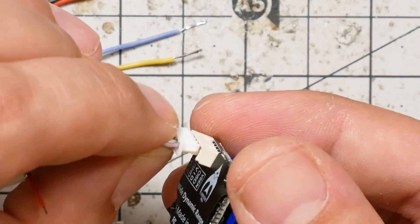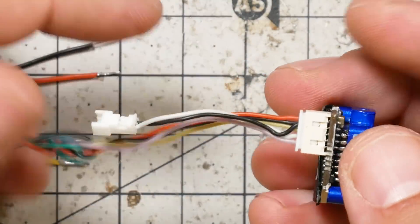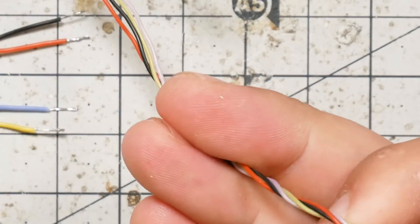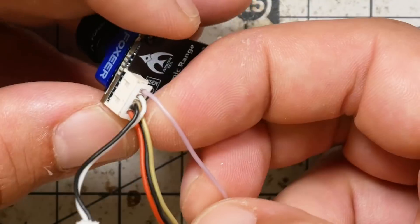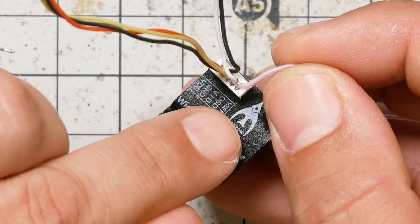Take the end of the wire and plug it into the camera — one end will plug into the camera, that's the end you want; the other end will not plug into the camera, that's the end you're not going to use. I'm going to take the camera end and pull back these wires, giving myself a nice healthy length of maybe five inches or so, and I'm going to strip and tin these as well. I don't need the light purple wire — that's the V-SEN wire, the rightmost wire coming out of the plug header. And this is where my memory card filled up and my camera stopped recording — but that's okay, I was almost done for today. You can go ahead and snip off that V-SEN pinkish-purplish wire from the camera, you don't need that — just take your diagonal cutter and cut it. We will continue in the next video.